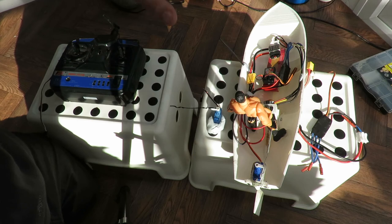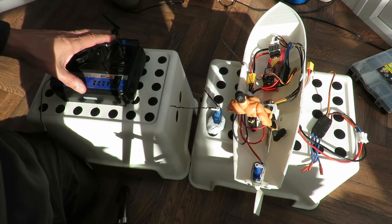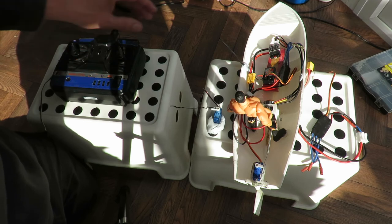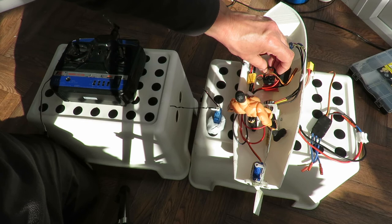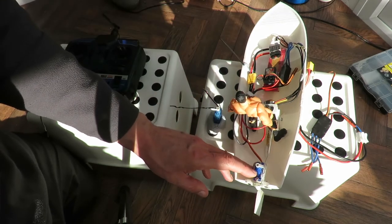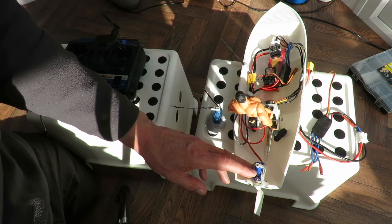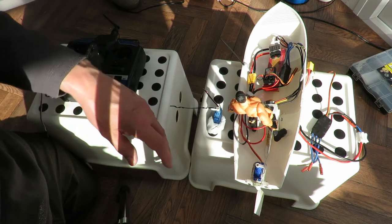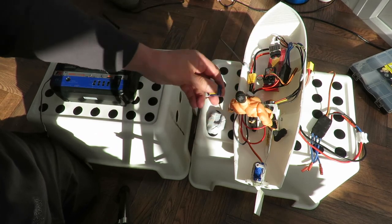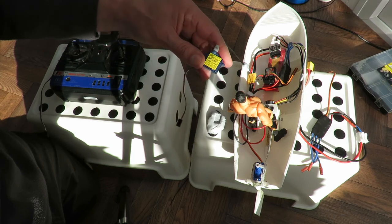It may be an incompatibility of the complete setup. I use FlySky because it's cheap on eBay. So FlySky transmitter, FlySky receiver. I wouldn't know which brand servos I'm using. They were just the cheapest I could get on eBay, 9 gram servos. And set up like that, it works. If I use that servo, we get problems.